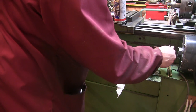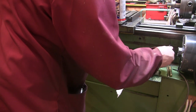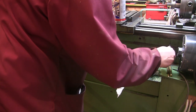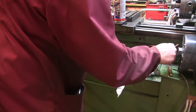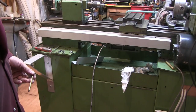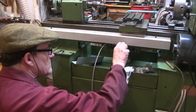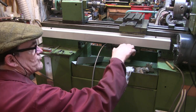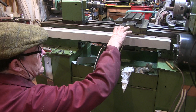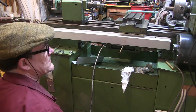I've had to re-drill these holes and tap them. It was just a little bit - even as low as I could get the actual scale - when I got the cover on it was just a little bit too close to where the bolts come through for the reader, for the slidey bit. That's why I had to re-drill the holes and drop the scale down a bit, because when this was screwed in it was rubbing on here. I'm glad I remembered this piece had to go on.